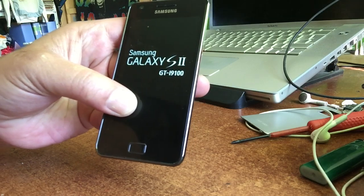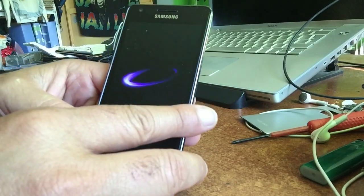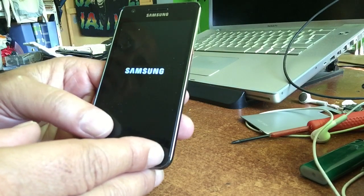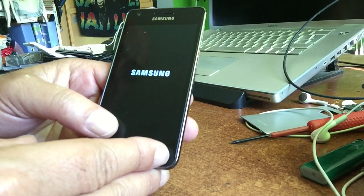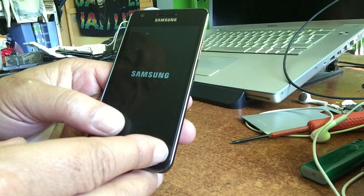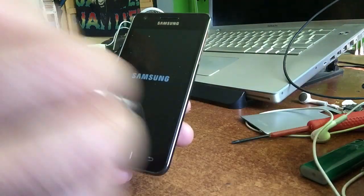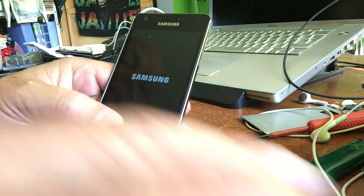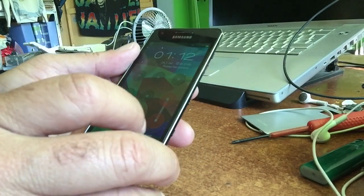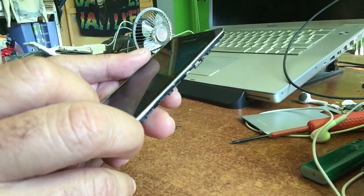This tip was thanks to another friend of mine, and also thanks to Tudor for finding the solution. So this morning when I stood up, I was like, before I throw the phone away, just kidding, we can always use it for parts, we're gonna simply remove the little capacitor. It's really small and you can just lift it off with a little screwdriver and then you will have a fantastic phone. Of course, this phone is locked. I cannot get in. I don't know what the guy did.